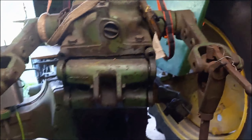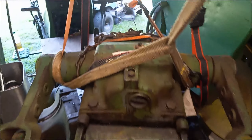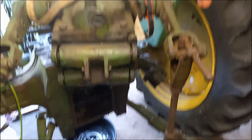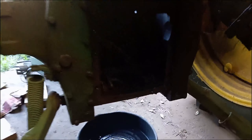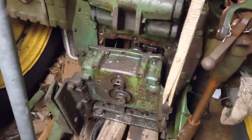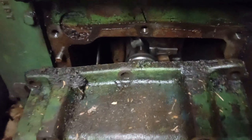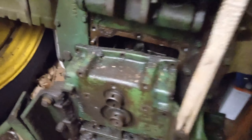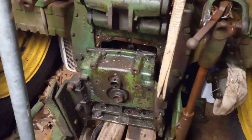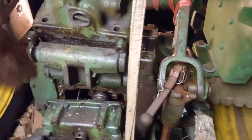The bolts that hold this back part to this are here — here are the back two of the large ones; the front two are over here. Then you should be able to lift this bad boy and get to the PTO output box itself, which would go here. This is what we need to work on. We need to get that yellow spring off and maybe something else to get this whole PTO clutch assembly thing out.